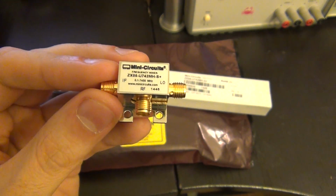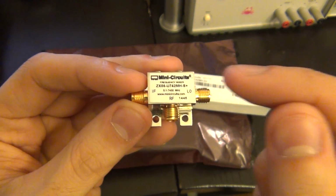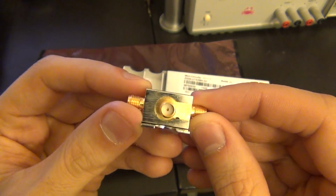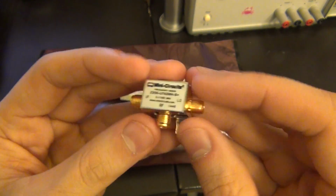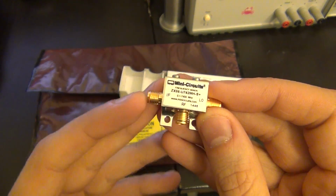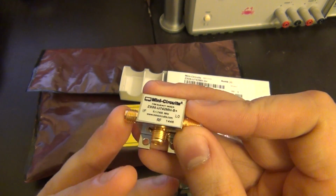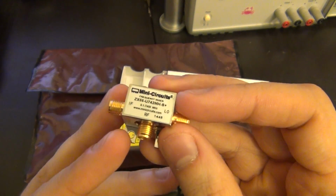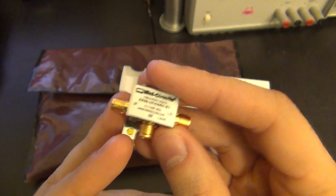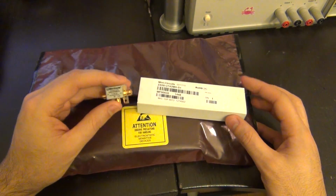The second converter stays where it is, but now I'm going to have to switch the LO between this one and the mixer that was there, and I have a way of doing that. I have a microwave switch which we can add. So there's some construction that's going to happen. And now, of course, once I change the mixer, the conversion gain is going to be a little bit different, and the instrument is going to require calibration. But hey, that's one way to do it. We're doing this for fun anyway, so we can see if this method will work. So first things first, let's go ahead.